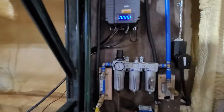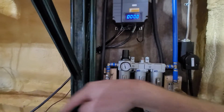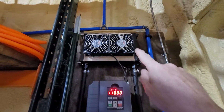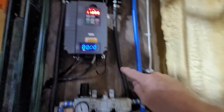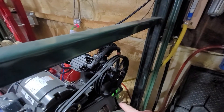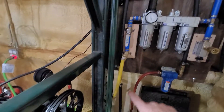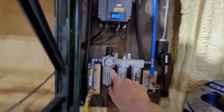So here's the rest of the system. The air comes out of the compressor, goes up through this line to my dryer — a heavy-duty transmission cooler with high-speed PC fans that come on with it. It then comes out of the dryer, goes through a water catch, and into the tank. I catch a considerable amount of water there while it's running, so it's not making it into the tank.